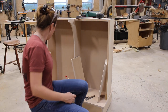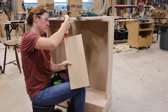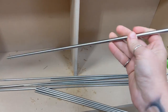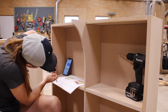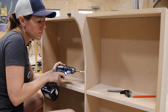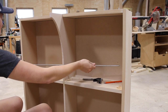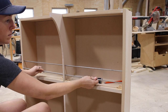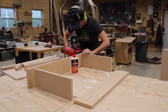Let's go to the inside of the unit and add in some shelves. You could add as many or as few as you want, but I personally only wanted one shelf per side. My plan for keeping things from falling over is to run small metal tubing across the front. I made all of my location marks using a square, then counterbored with a drill bit just slightly larger than the tubing. On the center divider I made a through hole so I could feed the tubing in from the left, go through the center, and into the right wall. I'll glue these in later but for now left them dry and moved on to making the doors — a really similar process to making the body — starting by building a box using wood glue and brad nails.